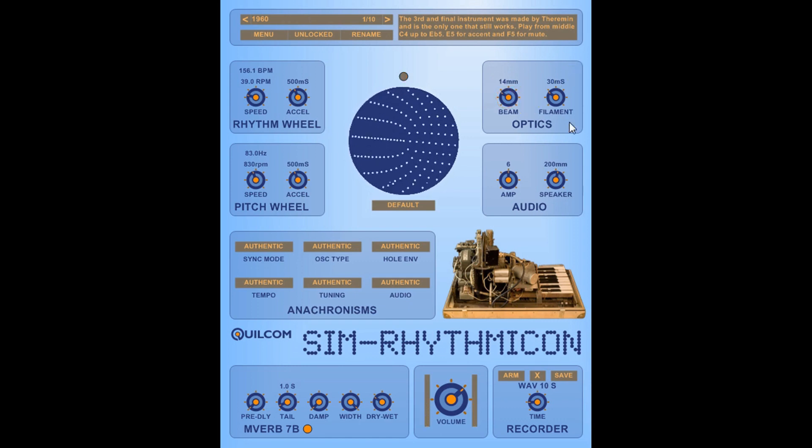A filament lamp has a certain time before it's fully bright — a sort of warm-up time. I've got no information on this, so I've set a wide range to simulate that warm-up of the filament lamp, which will affect the startup of the sound. If I set it very long — 100 milliseconds — you'll hear the pulses increase in volume as the lamp warms up. 30 milliseconds sounds pretty good, or it can be instant, in which case you might get a click if you start in the middle of a pulse. So 30 milliseconds is pretty good.